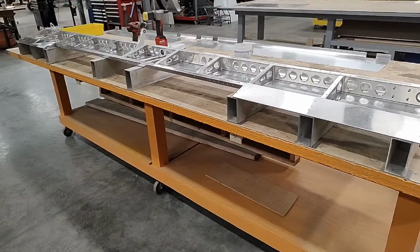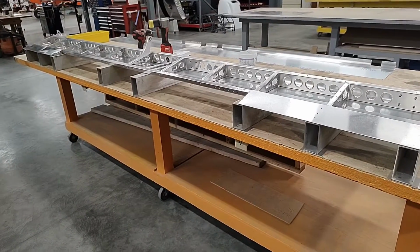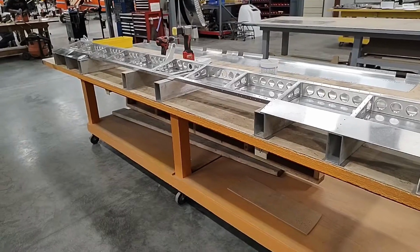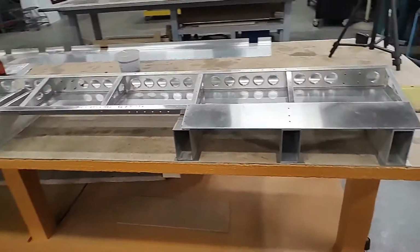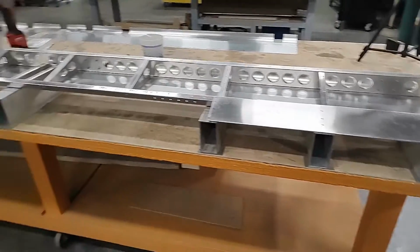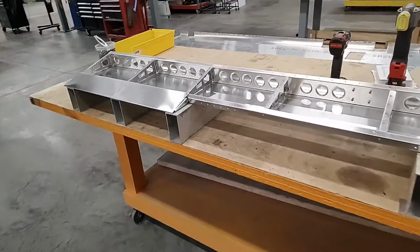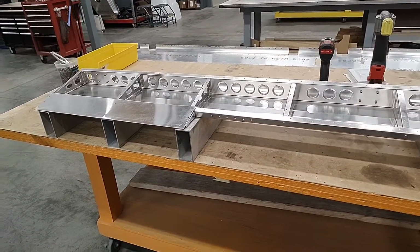Okay, we are back, and I have made quite a bit of progress on the elevator assembly. I have gotten it up to the stage in which I need the trim tab, so I'll talk to you a little bit about what I've done prep-wise. We have used our aluminum building blocks. We've leveled them perfectly, and we've assembled the framework and riveted the top skin on the elevator.